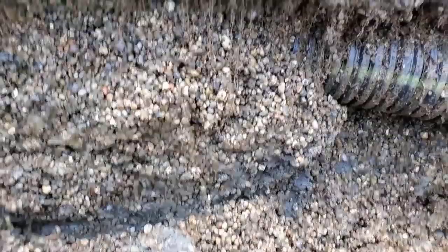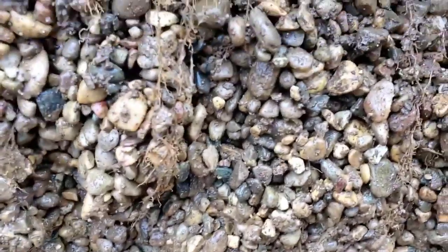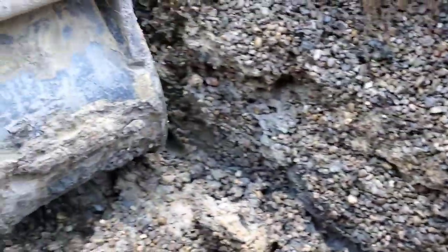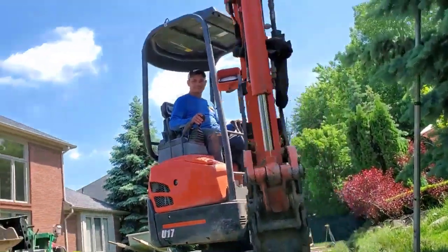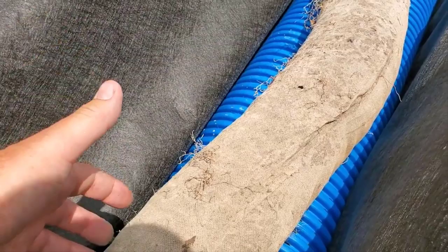I'm going to use this as an example of what not to do. Here's our pipe going down in there. See how pea stone just migrates into the subsoil — you can't get water to the pipe. This yard was a sewer, and if the original pipe had worked that wouldn't have been the case. The small voids from pea stone are a real problem. The aggregate migrated into the clay and the clay migrated into the aggregate — it just plugged.